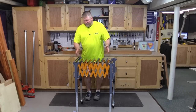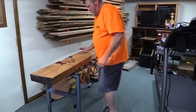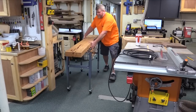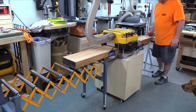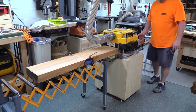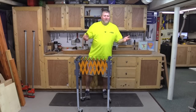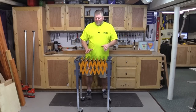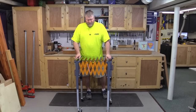I got this because I'd been doing heavier work going through my thickness planer, and eventually through my drum sander. The single rollers don't work well — it can be a hassle when a piece hits and knocks the roller over, or it's not supported enough and you end up with big snipe at the other end. So I got tired of fighting it.